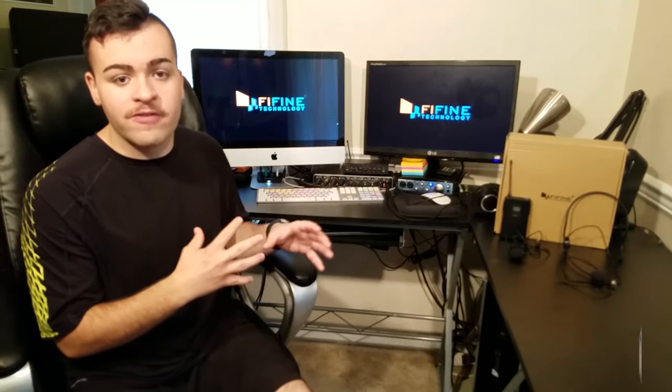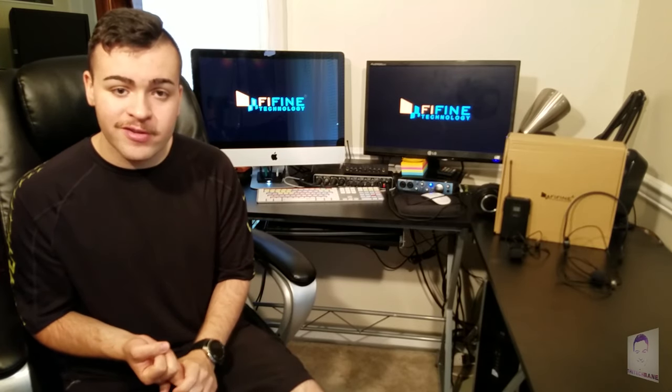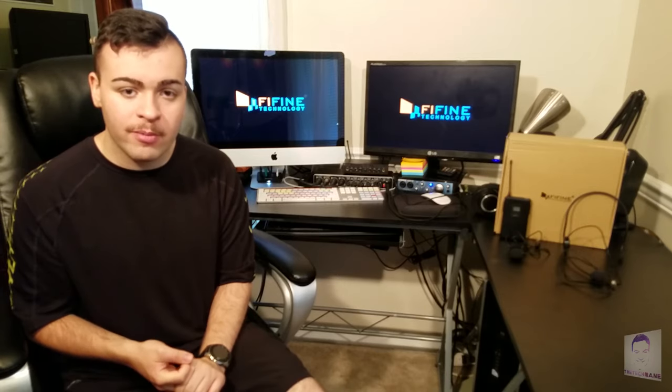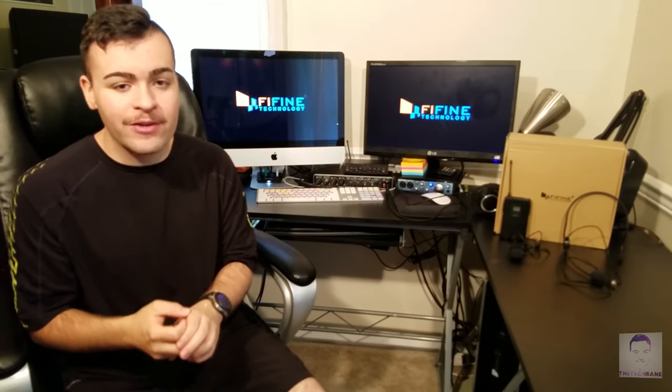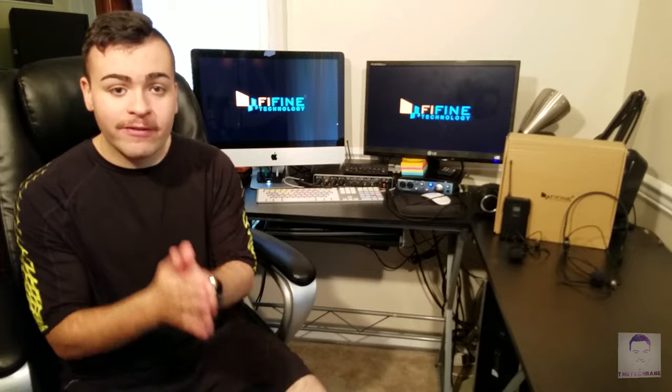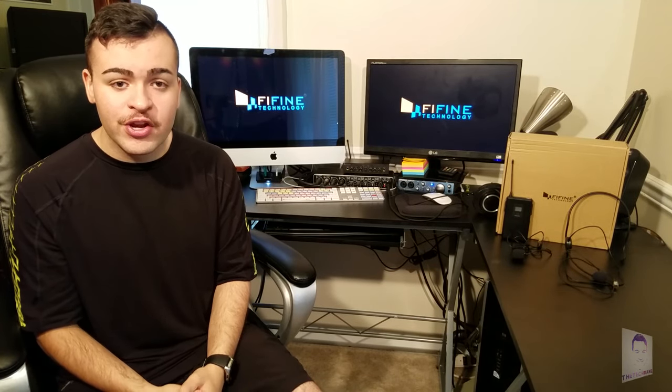So basically, in general, what I'm saying is that if this receiver had an XLR output, as is usual with modern wireless systems, I don't think the hissing nor the interference, if there is any, would happen because of the flipping polarity, as I said. So basically, if the audio was louder, it didn't have a hissing noise, and it had a balanced XLR output in the back, I think this would be way worth 5 stars. It'd be 1,000 stars. So basically, that is my review, and I give it a 4.5 because this system, for $82 and what you get with it, and the sound quality is amazing. It's awesome for beginners because you're not spending $100 or $200+ on a wireless system.